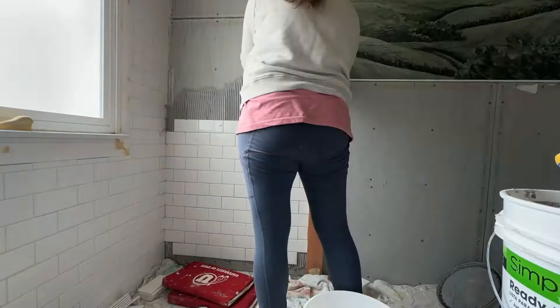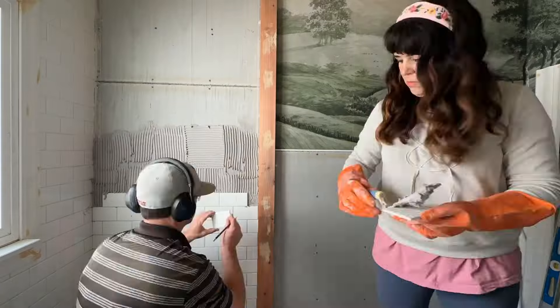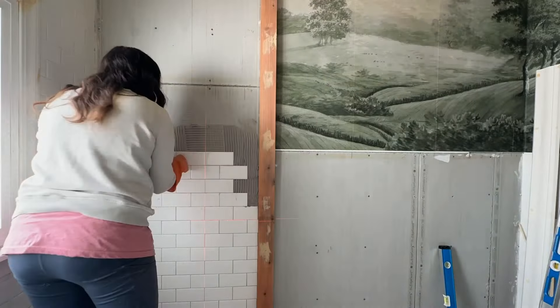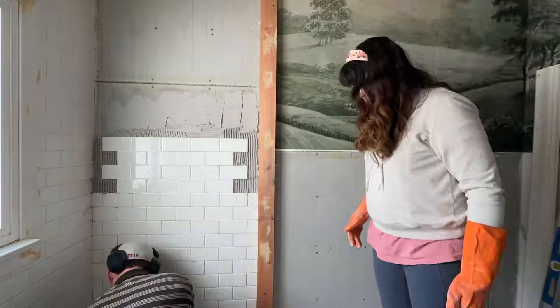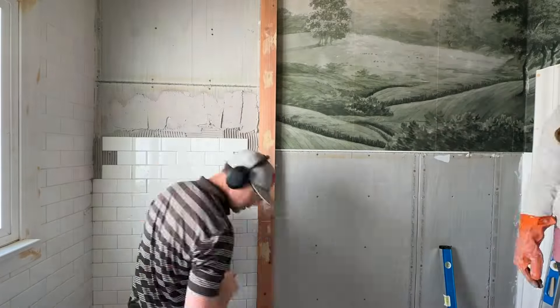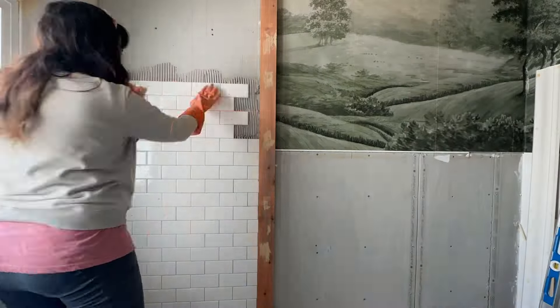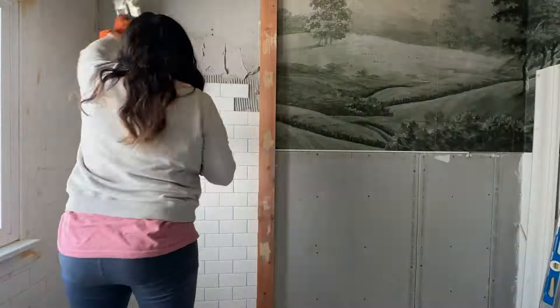The other reason I like it is you don't need spacers if you buy the right ones. I bought the cheapest ones at the hardware store — I can put the link in the description. The edge has a bevel to it, so when you push them together as close as you can, that little space on top is where the grout goes. If you have to add separate spacers, it's going to take a lot longer.